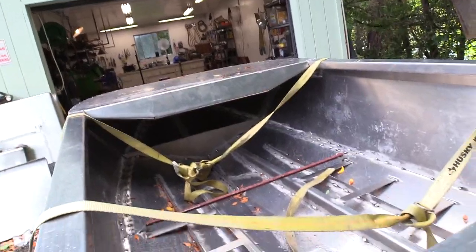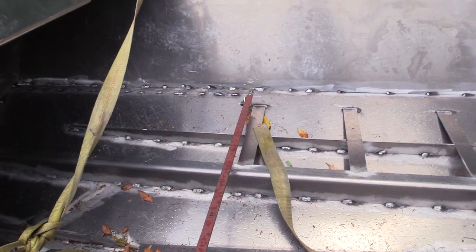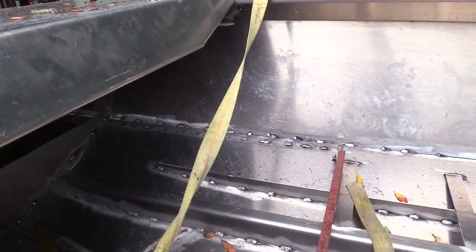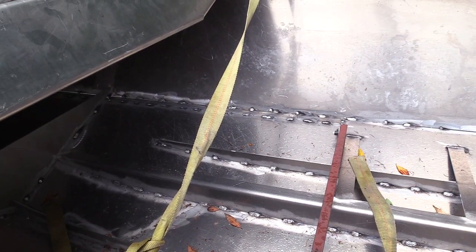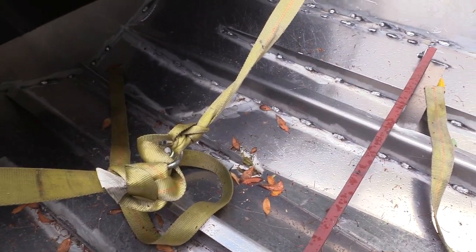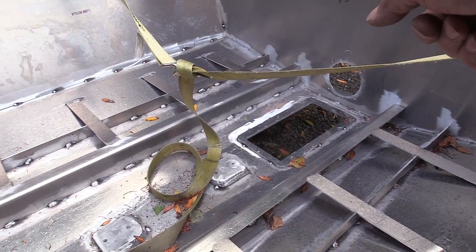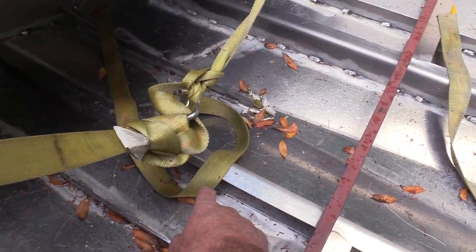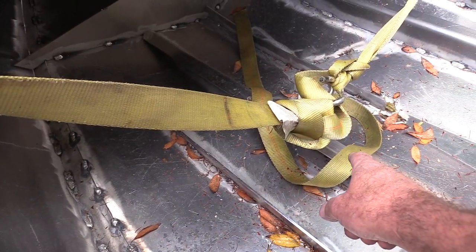So what that's going to do to you, because that flat bar on end is setting the angle of your outer hull plates, is you're simply going to have one side higher than the other. So that being the case, if I had 3/16 back there, just within a few inches, I probably had more up to where the edge of this keel is, and then you bring that all the way out to here. Okay, well that's compounding from side to side.